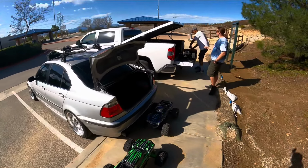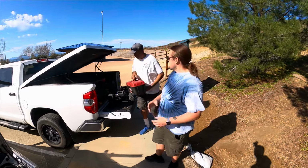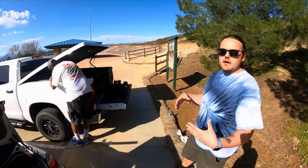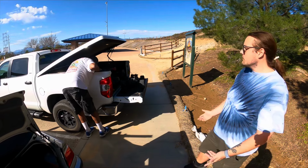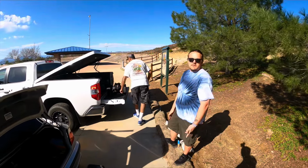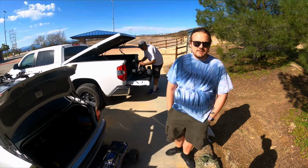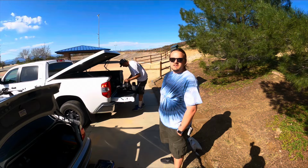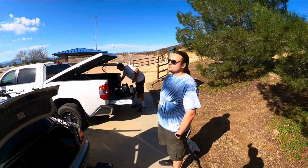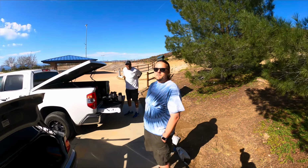Let me ask you one more thing. I think I'm doing the right thing in terms of LiPo safety. I bought a bat box. It's basically like an ammo box. I was going to do an ammo box, but it's a fire safe battery box. I'm storing them at storage levels. I have it in my house, but I'm charging outside. I just went down the rabbit hole of searching online for all the horror stories, and they're like little bombs. They are, and in the house, even in the battery box, remember, it's going to catch on fire on the outside. So if it's on carpet or near anything flammable, the best thing to do, if you have a barbecue pit outside... I do have a barbecue. Stick it in there. If you have a patio, stick it on the patio.